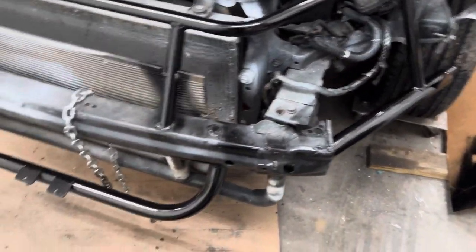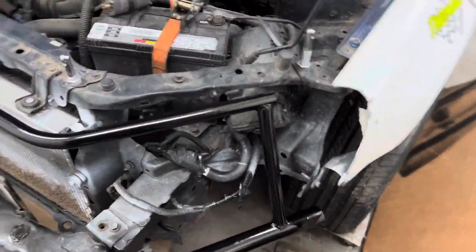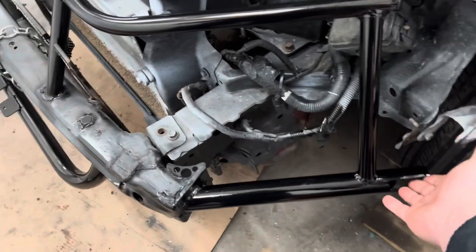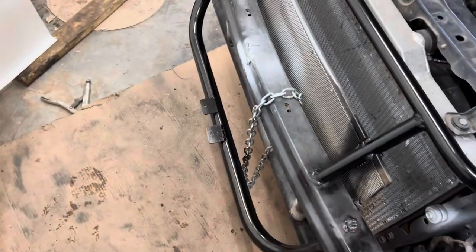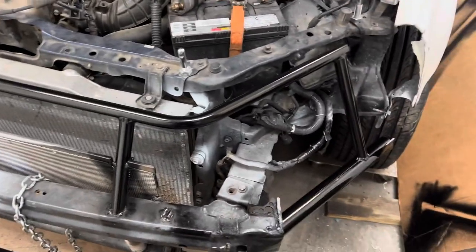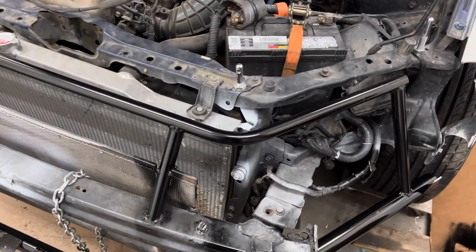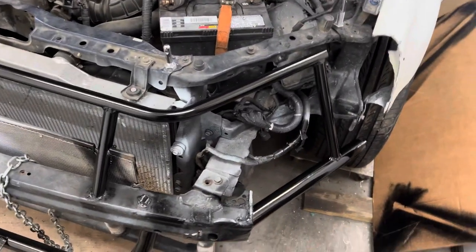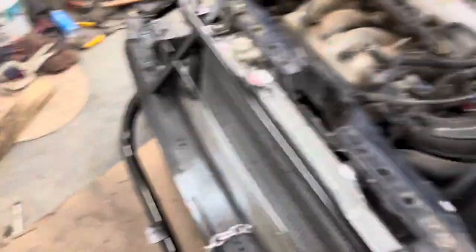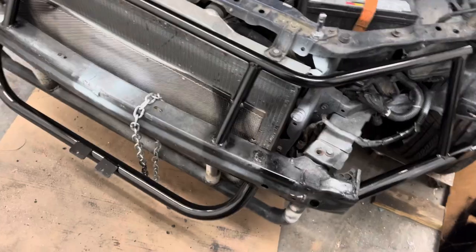I put a little bit of paint on it, it's all welded up solid. Got some legs down from the top bar to stiffen everything up and give it some protection. I welded tabs on to put bolts through — since Ryan wants it bolted. Tabs on the fender, tabs on the front through the grill hole, and another tab on the other side. At this point I need to grab some more bolts and then we should be able to permanently mount the nose. We've got a nice strong bumper — strong enough, hopefully.